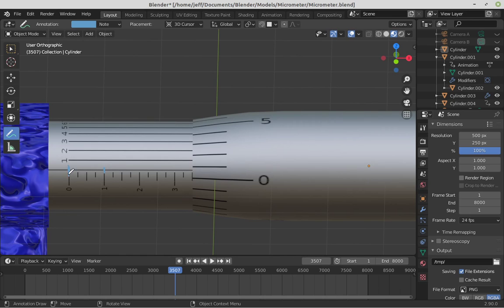First off, which tenth of an inch were passed. If we passed the 0, the 0.1, the 0.2, the 0.3, or so on. Let me just choose a spot. Let me go a little bit further. Well, actually, where I am right now, you can see I'm past the 0.3. So where I am right now, I'm past the 0.3, so my tenths place reading would be 0.3.